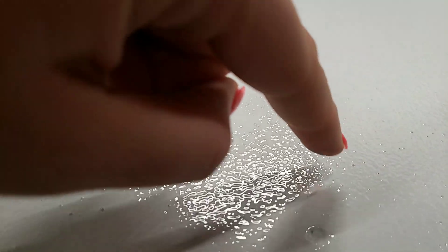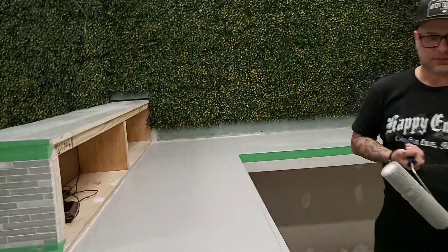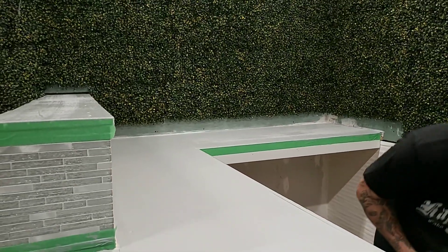Does it look like there's air bubbles? Because this definitely is air bubbles. So if you end up with air bubbles, that means your wood is breathing — and that's no good. Because if it's gonna do this with paint, it will do that with your epoxy as well. So you need to make sure you seal whatever you're going to resin over well enough that it's not gonna have air bubbles.